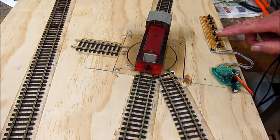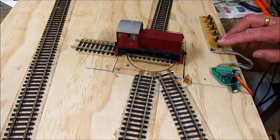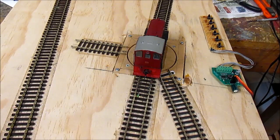One of the things you will notice: if I say go to track number two, it will go past the track slightly and come back again. This is just taking up the gear backlash so that we can get proper control of the turntable and accuracy in positioning. If I didn't have that, in one direction it would not take up the backlash, so you would have issues trying to get it to work every time.